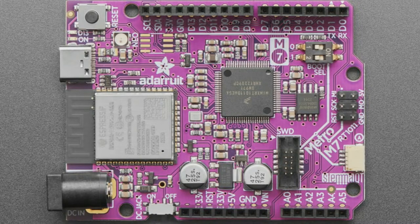We've paired it with an ESP32 for Wi-Fi and possibly Bluetooth. Some neat things you can see here: this is a two-layer board. These chips are designed to be low-cost upgrades from M4 or M3 chips. You don't need a separate PMIC — just an inductor, capacitors, and passives in the top left. On the right, there's inexpensive QSPI memory; we use the Winbond W25QJV series, 64 megabit, 8 megabyte. Give it a 3-volt power supply and crystal and you're pretty much ready to rock. It's also got built-in USB.